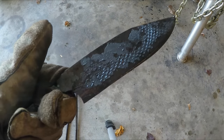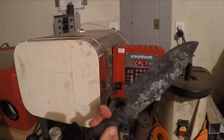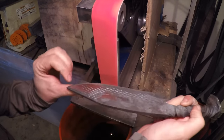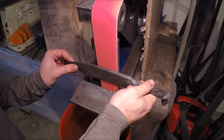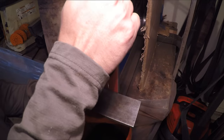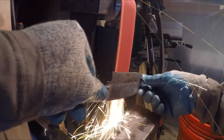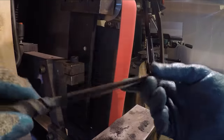The file steel got plenty hard. It's been in the oven for two cycles at 400 degrees for an hour and a half each. Now I'm going to do some more grinding. There are two schools of thought: you can do most of your grinding before the quench or heat treat, which leaves you prone to warping because there's less steel to keep the knife straight, but you use less abrasives and it takes less time because the steel is softer. Or you can do most of the grinding after the heat treat — you're less prone to warping or cracking, but it takes longer and you use more abrasives, which can be expensive.